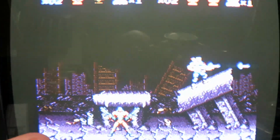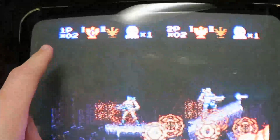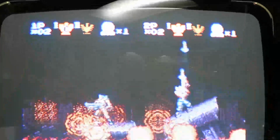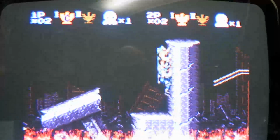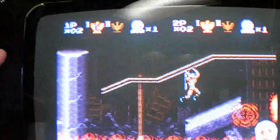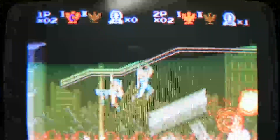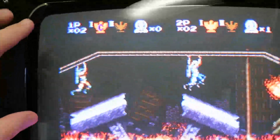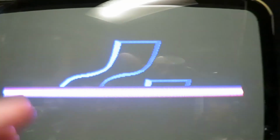Super Nintendo, if you don't know, runs at a typical horizontal resolution of about 256 pixels. I believe the number isn't exact, but 250-ish, I guess. With other emulators, we can have, let's say, up to 320, even more in some cases. And since we're drawing the pixels at pretty much the same frequency, no matter which emulator we're using, and this is the default operation of how this is all set up, there's something we can do to change that.